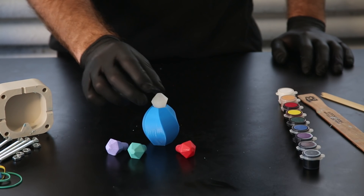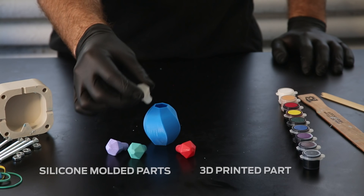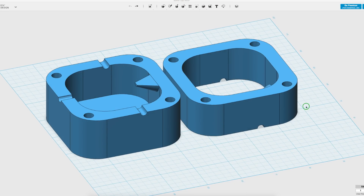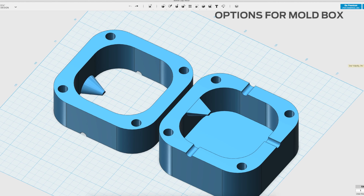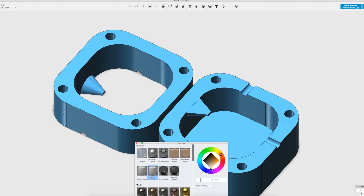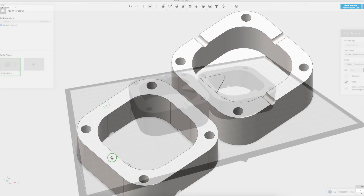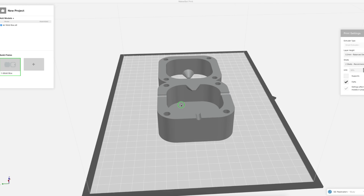First, we will show you how to create a mold around a 3D print. For our print, we chose the top to a perfume bottle. Here you can see the printed part versus the parts created using silicone molding. When pouring the silicone to create your molds, you need to create a box or container to bound the molds. You can use foam core board, Legos, or a cup depending on the size of the model. We decided to 3D print ours. Our mold box included a printed pour spout. If you're using foam core or Legos, you'll need to make room to pour resin when creating your mold. You can use a funnel to do this. The silicone molding process doesn't require any special settings, so we chose our default settings in MakerBot Print.